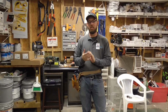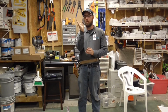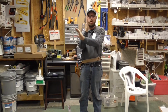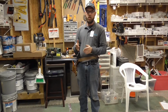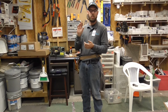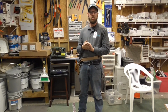Great video to watch. All right, to recap, so what we had is a dishwasher that was leaking from the front at the door. Upon inspection of it, the pitch of the dishwasher is supposed to sit like that, where you want the back end to catch most of the water. It was more like this at the door, so the water was coming to the door and leaking out, bypassing the gaskets. So what we ended up doing was just lifting it up on the front by tightening up the legs and the securing screws at the countertop itself, just so it wouldn't lean forward anymore. But easy fix, another day for a work order.